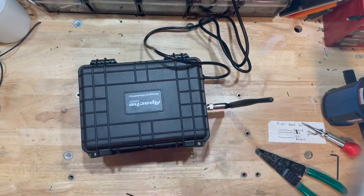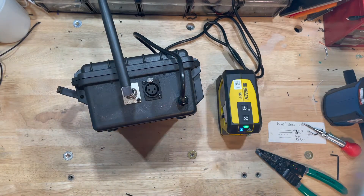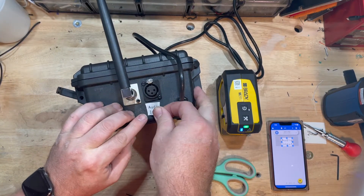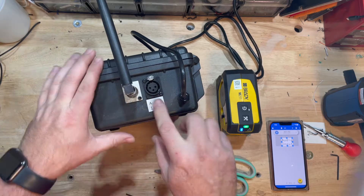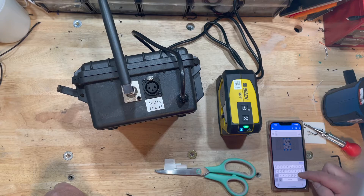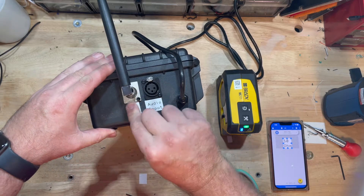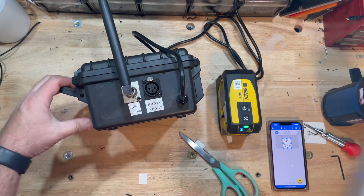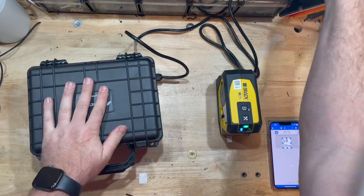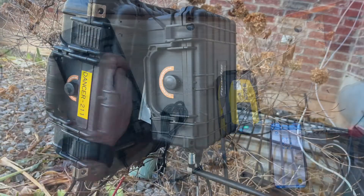Now I'm populating the antenna on the outside. This is the antenna that came with the transmitter, and I used it as-is since it's so close to the road where I'll be transmitting. If you want to extend it, it's much easier to find a 50 ohm BNC cable to extend it wherever you want. I'm a big fan of labeling everything — audio input on the right, 50 ohm antenna on the left. Everything fits nice and neat in the case, so I fold it up, put a zip tie on it, and it's ready to take outside.